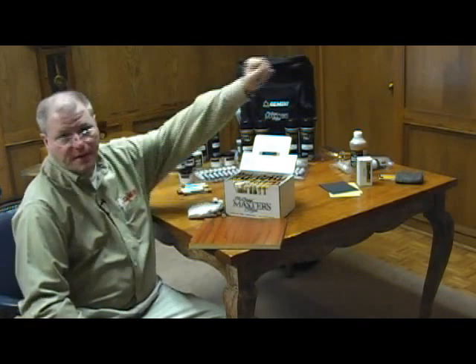We're going to work on a wax stick repair. Wax sticks are available in 96 different colors. Wax stick repairs are typically used for minor repairs — small nicks, small scratches, maybe a nail hole or small imperfection — typically below countertop level or above where we can comfortably reach. We need to remember that a wax stick repair is always a temporary repair. It may last five seconds or 25 years. It will never be any harder than it is right now — it won't harden over time.